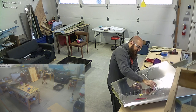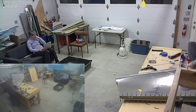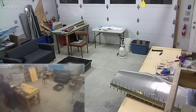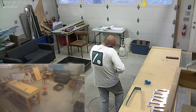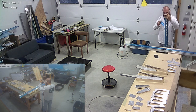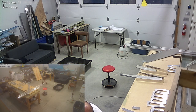So you see how it's a really nice green finish for the primed parts. That primer is very, very sturdy. It works. It's incredible. It's an extra step. It's definitely not a required thing to do. A lot of airplanes out there are not primed and they're fine. I definitely like priming parts, and especially for parts that have been around a long time. I think this kit that I purchased, this empennage and wing kit, is 10 years old, so it's already been sitting out. Personally, I like having it primed, and it just gives it that extra longevity.